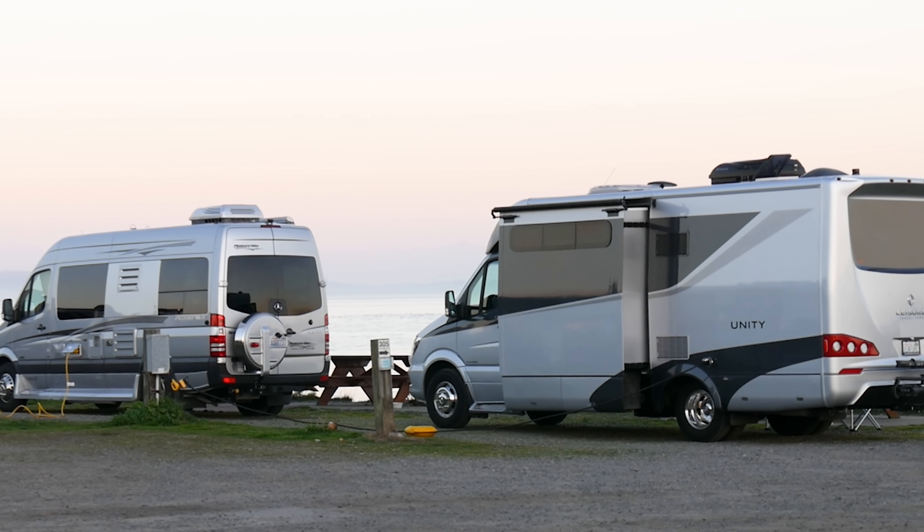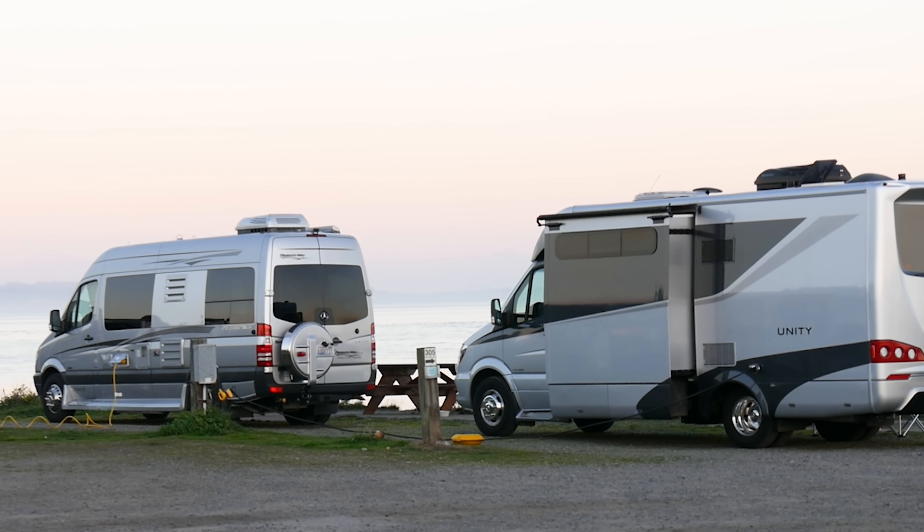Now keep in mind, we do have a larger RV with more space for more solar panels. If you're in a smaller rig, you may still have a larger battery bank but your solar may be a bit limited, which means you have to rely more on a secondary source of power for charging. So yeah, if you're in a small Class C, a B, or a van, then a DC to DC charger is definitely a wise investment. But let me know what you think of this setup, and if you've tried something similar, I look forward to hearing what you have to say. I hope it helps you out and gives you some ideas — take care and I'll see you in the next one.